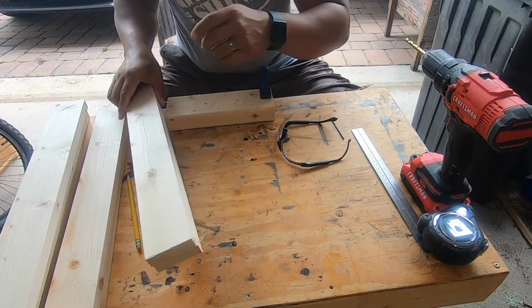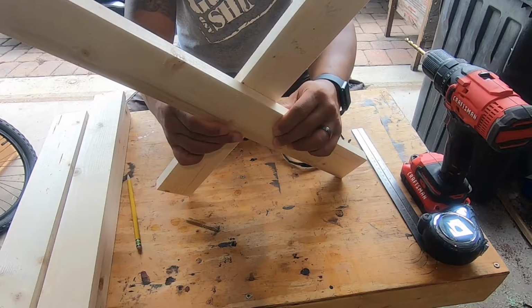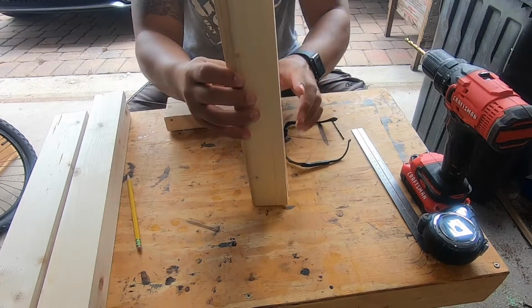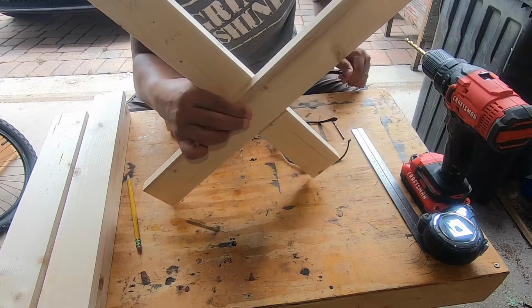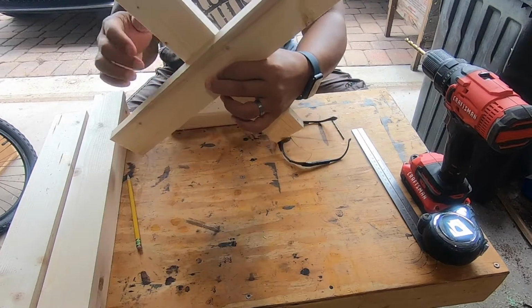The way that this works is going to be pretty much that's on the inside. So the frame will sit similar to that, and then when we collapse it down, they'll go together. So they pivot here. It's going to be a 1/4 inch by 2 inches bolt straight through with a washer and nut. So now I just got to measure out and drill the hole.